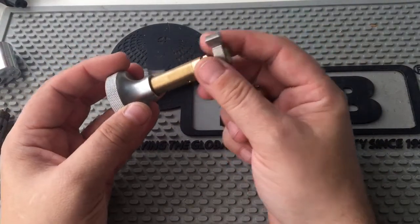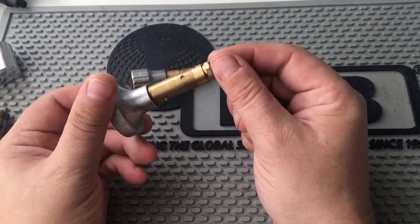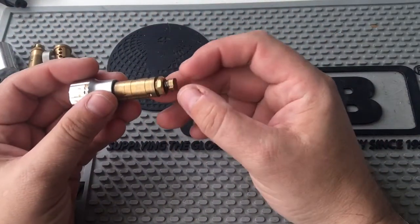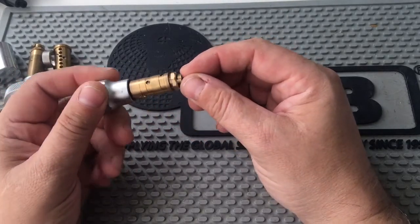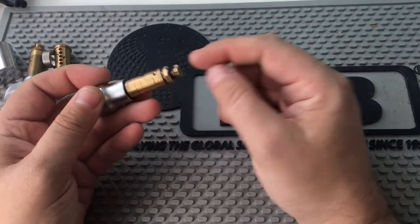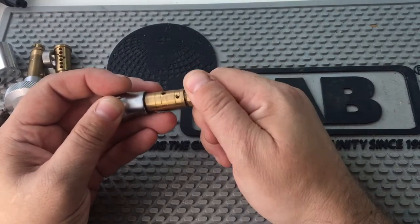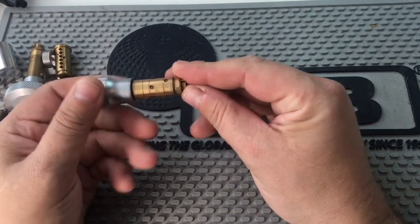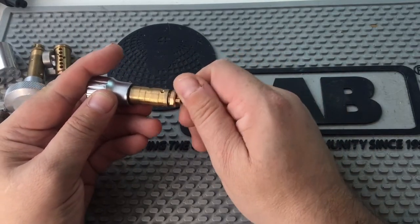But the clutch mechanism in here is not that strong. It's a thin piece of brass, and it's not designed to be that strong. But again, if you just torque it and something is preventing the cam from rotating, this happens. As we can hear, there's no click. So what happened is when you insert the key and you rotate, the key rotates the cylinder and the plug rotates, but the thumb turn, and by that the cam mechanism, doesn't move anymore. It's just stationary because there's nothing to link the two parts together.